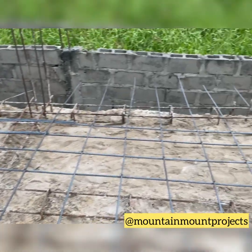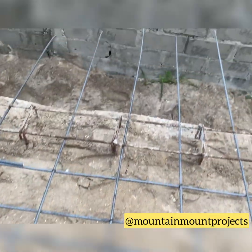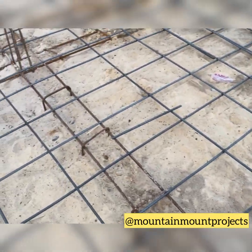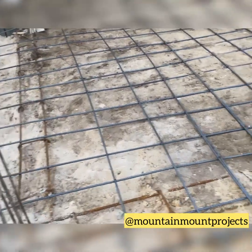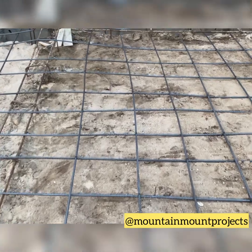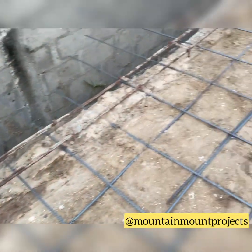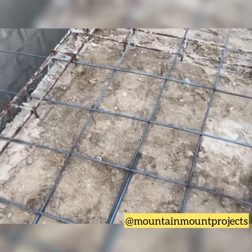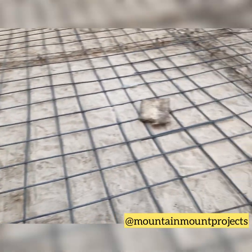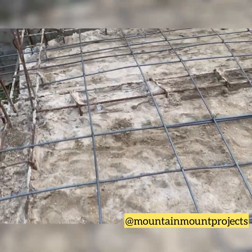After laying these mats, you're also supposed to put the nylon — but that's not really necessary. What is most important is to lay the mats perfectly because they're going to hold the iron rods of the foundation together. The iron rods need to be laid carefully, and underneath the foundation iron rods, binding wire needs to be used where it's needed. It needs to have been filled and rammed well.